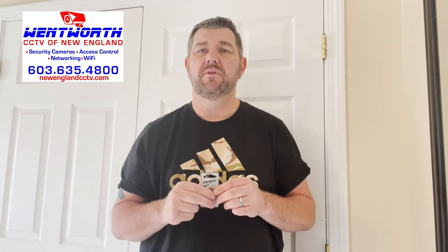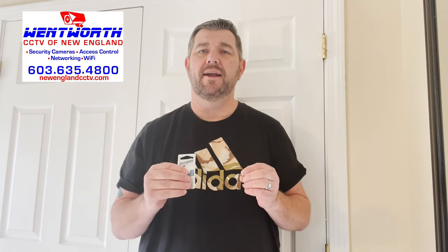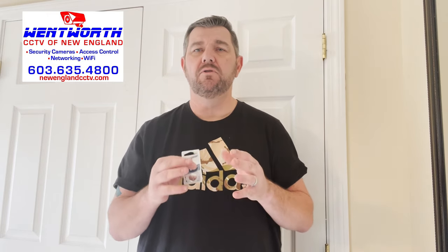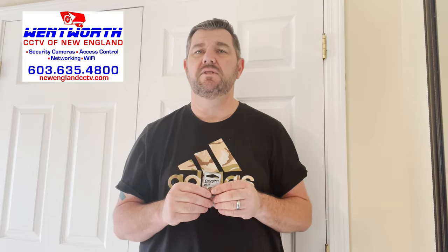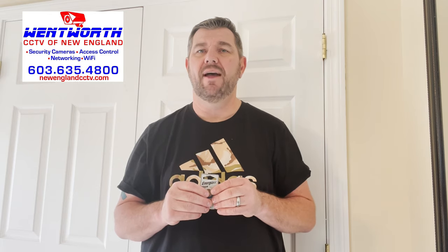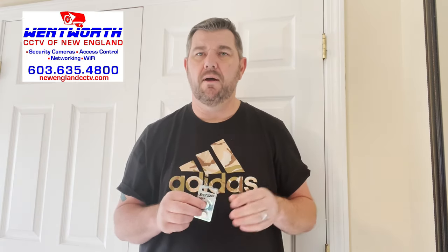These batteries will last a couple of years — two or three years — and they pretty much hit their lifespan. When they die, it's problematic because when your security system recorder reboots, or if you have an intermittent power outage and the recorder starts back up, the timestamp on your video isn't going to match real-time. That's problematic if you have an incident and need to research it by date and time, or if you need to burn video for the local authorities or your insurance company — if the time/date stamp does not match the actual video time, you're going to have a problem.